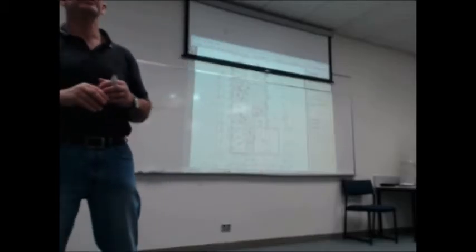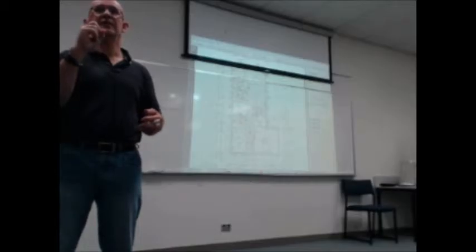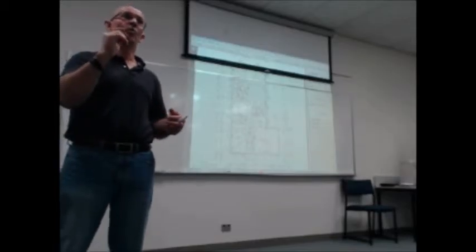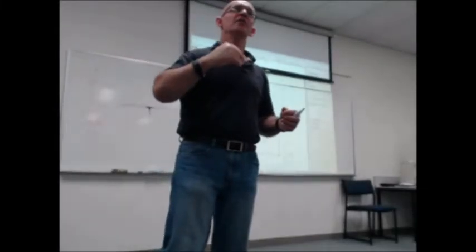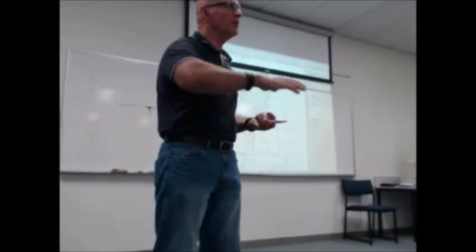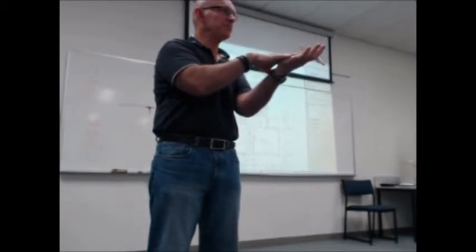But, like Andrew said, with waterproofing you get one chance. If it fails, it's going to cost you an arm and a leg. Ten years is your liability on that house. I saw one job, it was a $1 million unit, second story, and they used this Rolls Royce of waterproofing, a sheet membrane, heat bonded together on the lap.